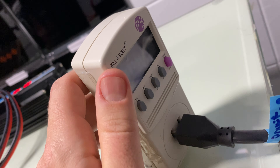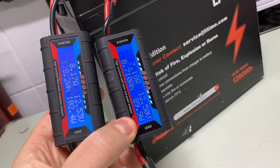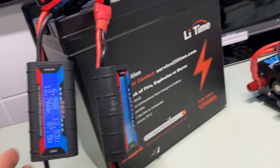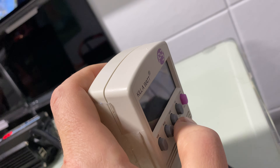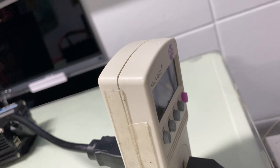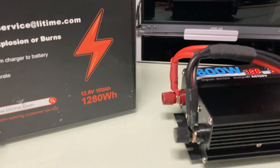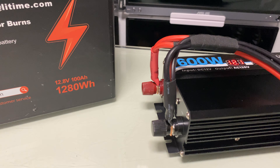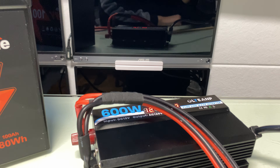Playing a 4K YouTube video clip, the fan noise is a little unbearable, I have to say. Looking at the meters: one shows 94 watts and another 92 watts, so we're probably more at 180 watts total. Actually, it's reading 260–270 watts. I was looking at the 120-volt display instead of watts. So the question is: can you handle the sound of this inverter running loud when it's doing 250 watts?